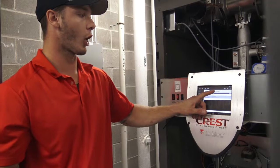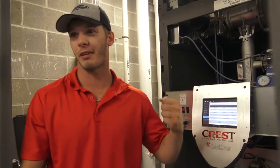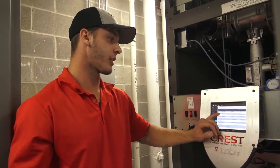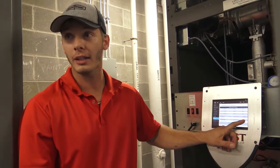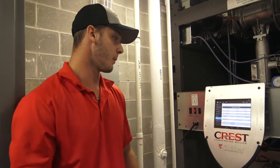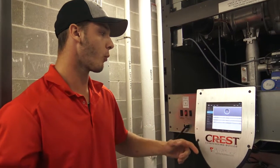And then you can also look at our runtime history. You can see how it's been firing. Has it been firing at 75 to 100% a lot? You know what I mean? Is it overrunning itself? 25 to 50%, I see 60% of the time. That's real good. I can see the total number of successful ignitions, how many times it's tried and failed, so I can come here and say, okay, was this a one-time thing, or is this a recurring issue? As far as there, you can see your modulation, what your pumps are doing.